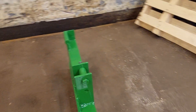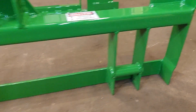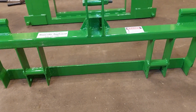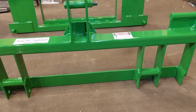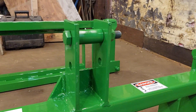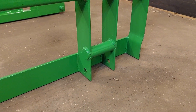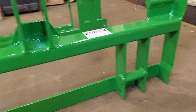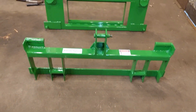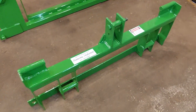When you look at the other side here, we've got the tower, and then these dowel pins here hook up to your John Deere Quick Hitch system. You can see slightly below that there's another set of holes, and the same up here, so that if you don't have the quick hitch, you can put pins through there and hook just straight to your three-point. This adapter allows you to put your front end attachments onto your rear three-point.